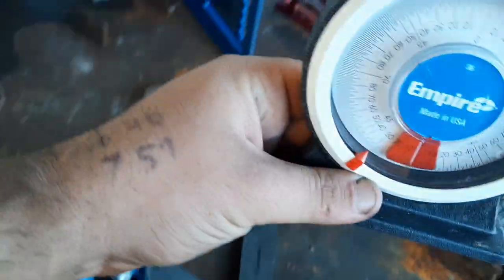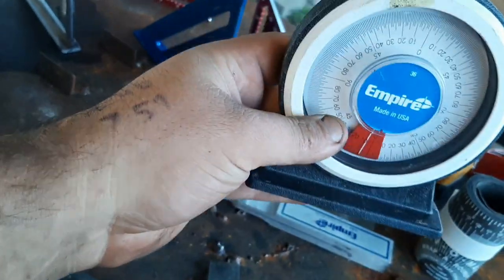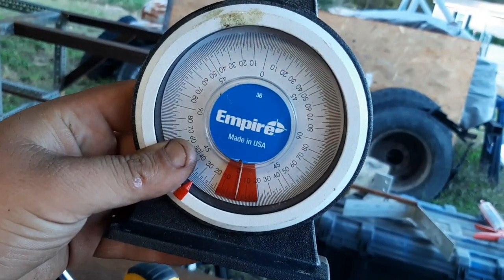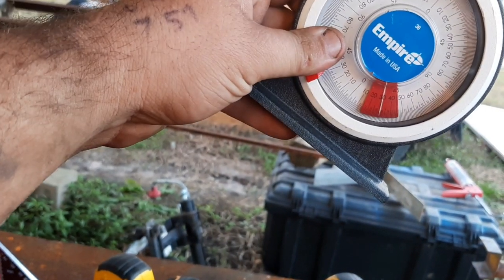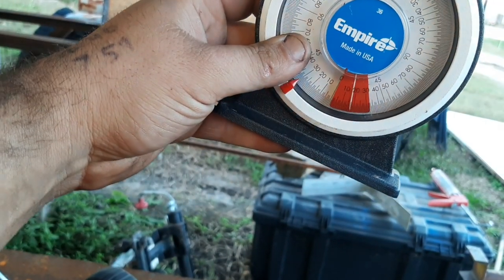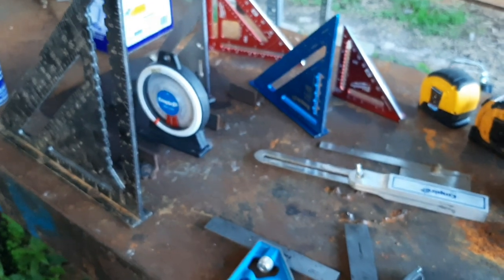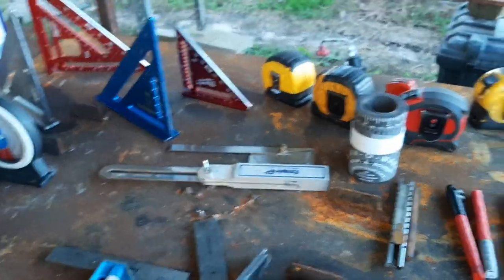Next really good tool — a mag protractor, angle protractor. Very, very good tool. Why would you have one of these on a truck? Mainly for finding out slopes of staircases. My favorite thing to do: take a piece of angle iron about 10 foot, stick it on a staircase, slap this bad boy on there, and it'll now tell me the angle. That angle measurement will now help me determine how I'm going to do my cuts for that piece, for that stair.